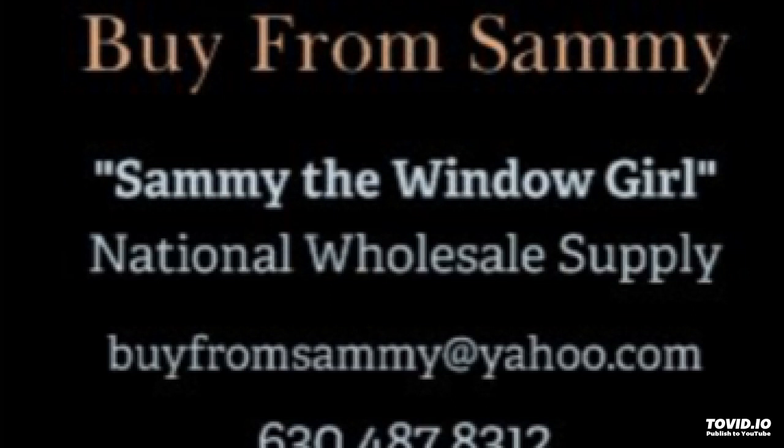Typically with the H-mull, you have to consider that it is a quarter inch in the vinyl industry — though it could differ. You have to check with the materials you're using, whether it's wood, aluminum, or vinyl, and factor in for your opening size what your allowance would be when using H-mullions or mullions in general for making a combination.